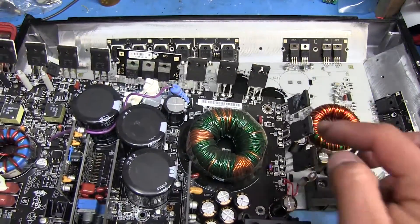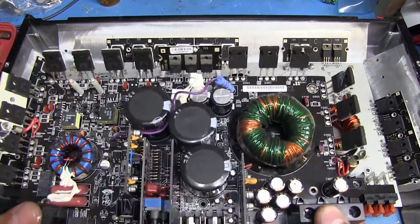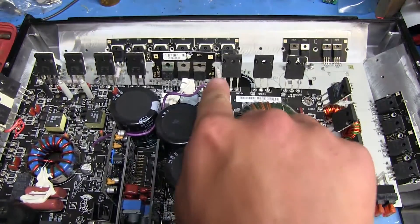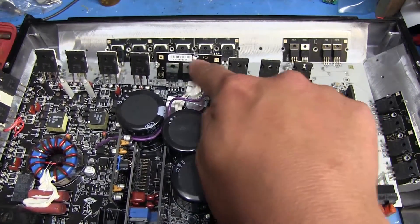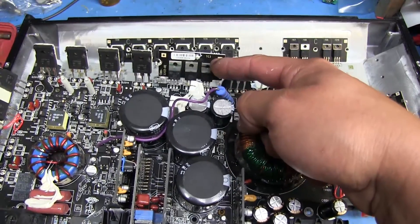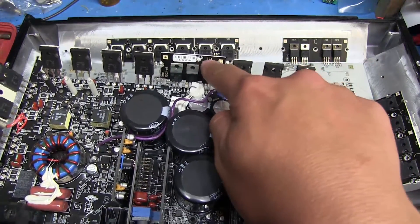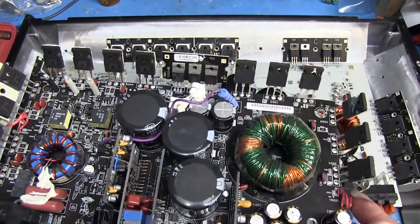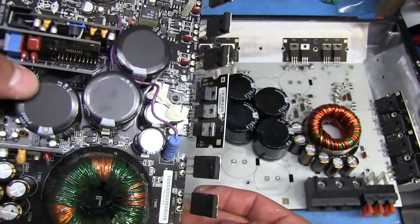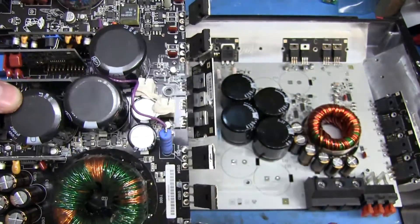Here's an example of another Rockford Fosgate amp. I've had amps previously fixed by other people where I've seen they tried to desolder these components off the thermal strip by heating up the tab with a soldering iron and then prying off the old part. To put the new one on they heat the tab and try to get it to stick, and it usually looks really messy with a big blob of solder. From factory they're pretty flat so they sit really flush against it, and that's how they dissipate heat.